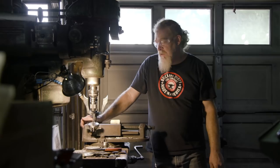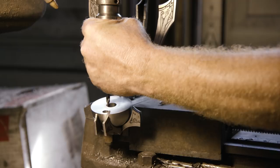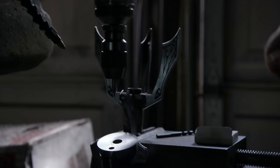What I'm going to be doing now is drilling to hide the spring down inside — it's going to be in line with the firing mechanism that's actually in the backside here. I've put a small drill bit in that hole so that I've got the angle. I'm matching that primarily so that when the spring comes out the other side, it's as high on the hammer as possible, giving us the most power. I'm going to cut that in on the angle, then come back in with the drill once I know it'll go straight from there.